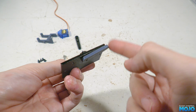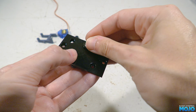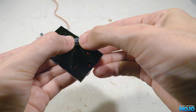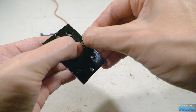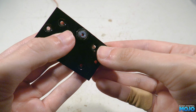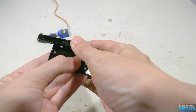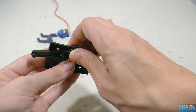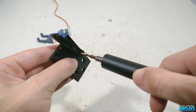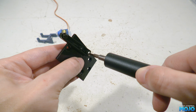Now to fit the lever, first we need to slide one of the thin spacers over the shaft. This is so the lever puts pressure only on the inner race of the bearing and doesn't lock the whole thing up. We need to make sure the spacer is all the way over the round part of the shaft past the key. Then the lever goes on and gets attached with the M3x20. For now, we just want to take up the slack in the thread. We'll tighten it up fully when the bottom of the screw is supported in the servo mount.